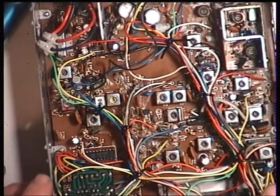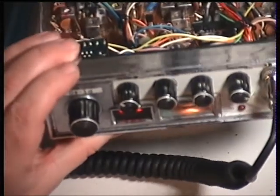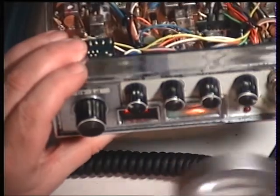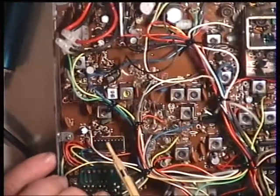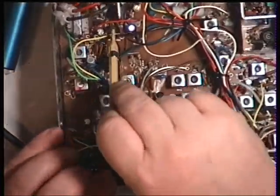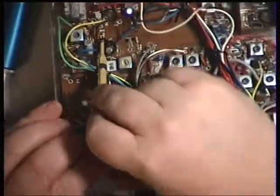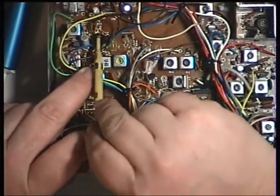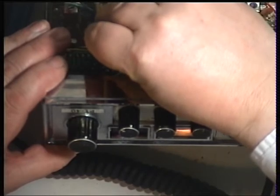Right. Now we'll look at the S meter and see what that's reading. Magnifying glass at this. It's reading plus 30. So I just need to drop that. Now we don't know which preset it is between that one or that one. So I'm going to go for that one. It's about to be the wrong one. But that didn't do anything. Yeah, it is that one. Just wants a bit of a clean. So presumably that final preset must be squelch. There we go, set S9.